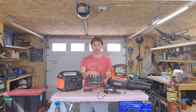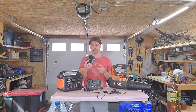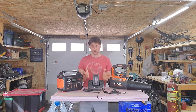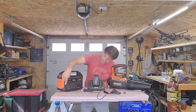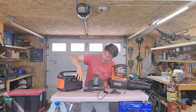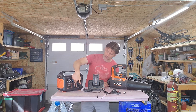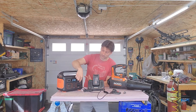That's pretty good, but down the line in this charger itself you've got electronics that then have to step down from 110 volts down to the voltage of this battery, plus it actually has to go into the battery itself. To charge this battery you simply plug it in like you would to the wall. There are several zones, so the electronics you're going to use only activate that particular zone. If I was charging my phone off the USB I wouldn't have the phantom drain of this inverter running in the background — I would just turn that off.